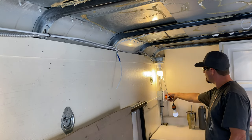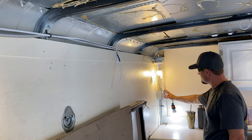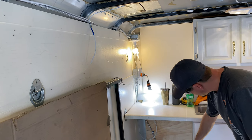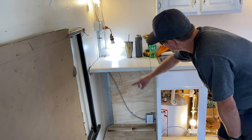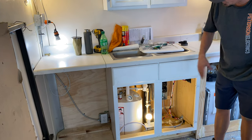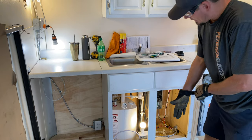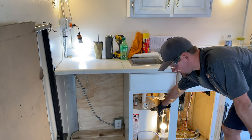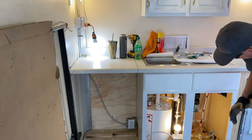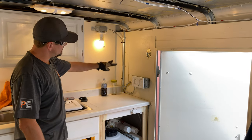Right here we have the same circuit as this one — this will probably be a coffee pot. This down here is a circuit off of the kitchen counter, and it is GFI because it is near a sink — it still applies to article 210.8 in the code book. He's got himself a little hot water heater, 1300 watts, about 11 amps. That little refrigerator he's putting in here is 1 amp. Coming across here we have another circuit — two circuits coming up, so I've got four circuits in this place.